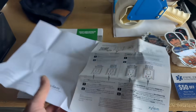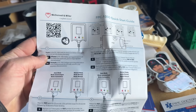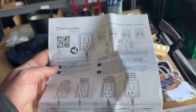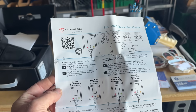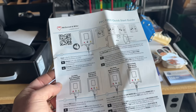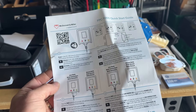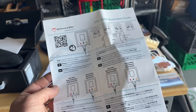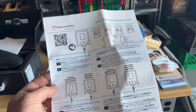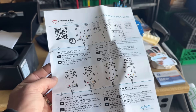This is going to revolutionize service trucks in the heating and HVAC world, because you don't have to carry four different low water cutoffs — steam automatic reset, steam manual reset, hot water manual reset, hot water automatic reset. Four devices in one for hydronic or steam heat, and two voltages in one for 24 volts or 110 volts.